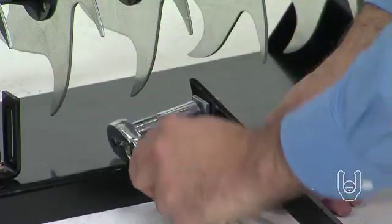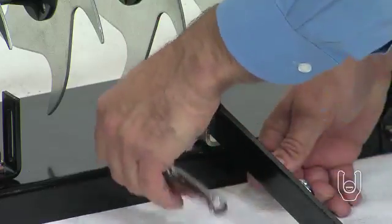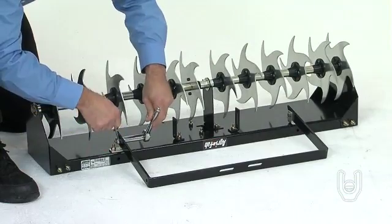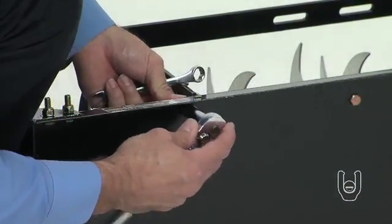Note that the ends of the axle bracket must point so that the angled ends are slanting up away from the tray. Fully tighten the nylock nuts, and then loosen the nuts 1/4 turn. Now tighten the nuts fastening the angle brackets to the tray.